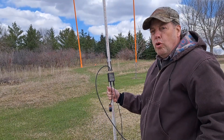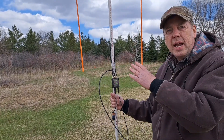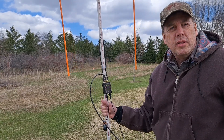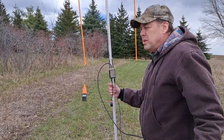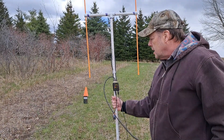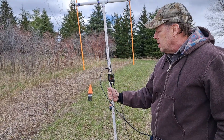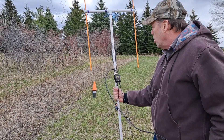As long as you do a little moving when you're rotating, it's really good to be walking. It kind of averages out the reflections and the multipath signals. You just try to keep walking and keep rotating it into the green. Here we are pretty much 10 yards away from the transmitter or less, and you can see that if I'm way off, it's telling me I'm not pointing at it. But the green again pretty much tells me I'm pointing right at the transmitter.